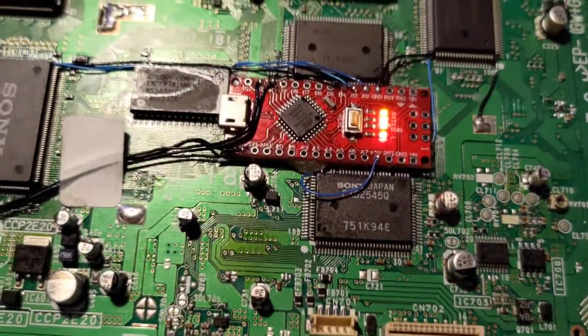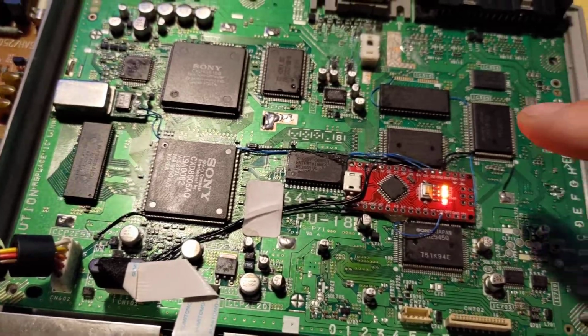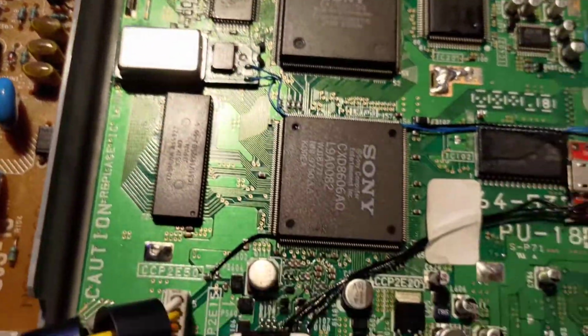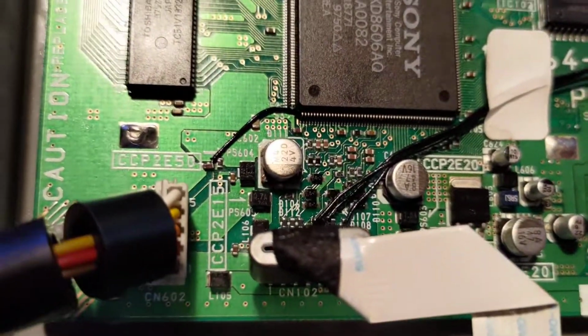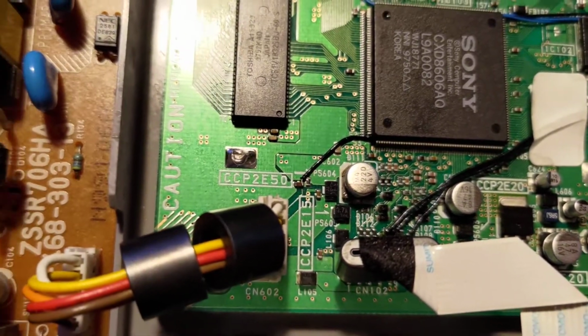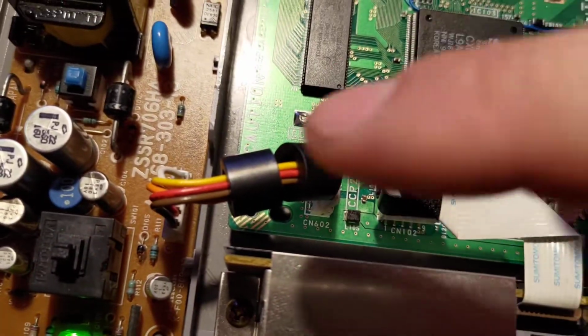So this is PSXTAL, PS Crystal. It's just an Arduino. That's a Nano 168P clone. And what that's doing is there's your reset line here. I got that alternate reset point off Will's console mods, so thank you. I didn't have to trace that one out myself. Would have just come off here, I'm guessing.